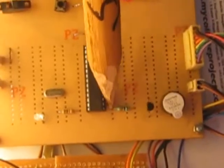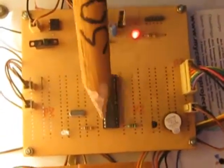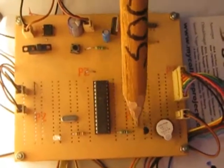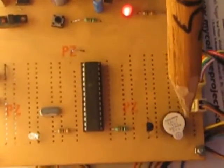When arc fault is detected, the buzzer is beeping. Before the buzzer, in the microcontroller we have one resistor and one BC547 transistor. This transistor is working as a switch. So when arc fault is detected, the microcontroller will give supply to this transistor, and when the transistor conducts, it will give supply to the buzzer and the buzzer will be switched on.